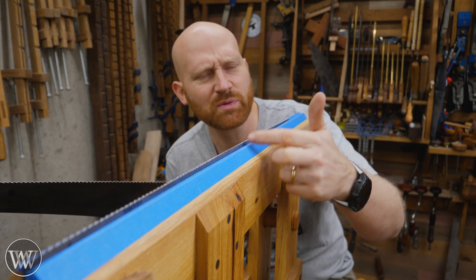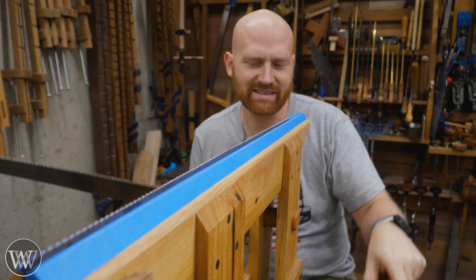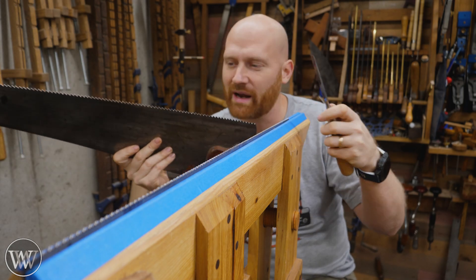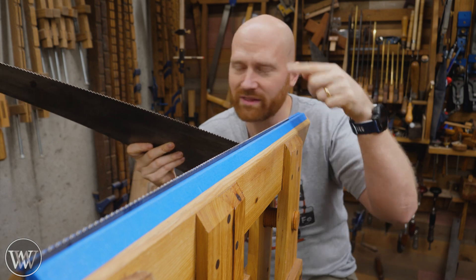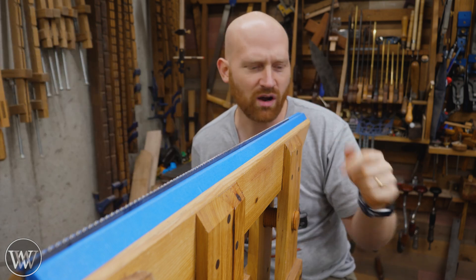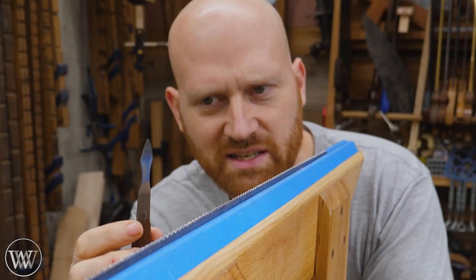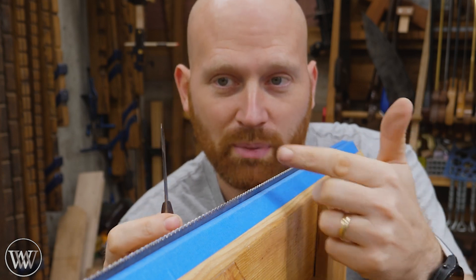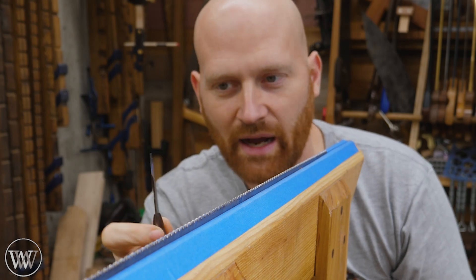But what exactly is the difference between a crosscut saw and a rip cut saw? Well, a rip cut is basically like a whole bunch of chisels in a row and every one of those teeth peels out a small piece. It's great when you go with the grain. But when you're cutting across, if you've ever tried to crosscut with a chisel, it's just a mess. In that case, the crosscut is basically a knife — a whole bunch of knives — each one cutting either side of the slot you're cutting out.